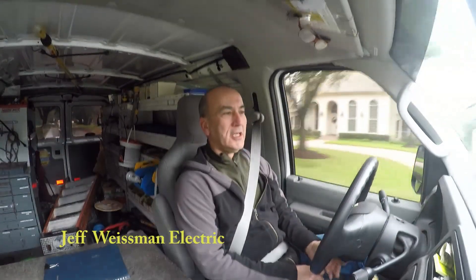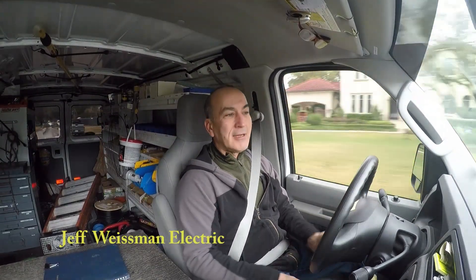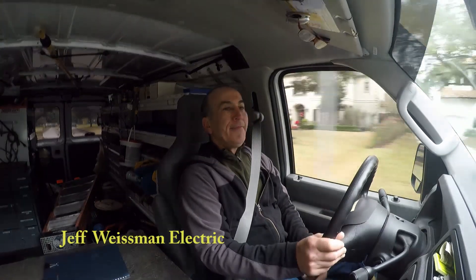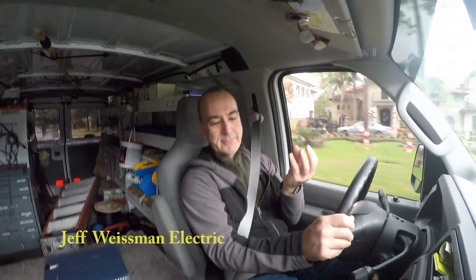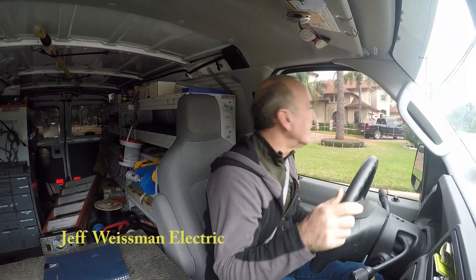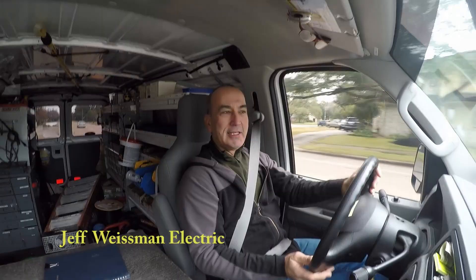The nuisance is your Christmas lights, your sprinkler system — and especially for us in the last couple of days, we got pounded with a lot of rain. The streets are still wet, there's still water standing in the streets. Water gets into the little socket of your light bulbs sticking up on the roof of the gutter. Water gets in there like a little cup, and that GFI is sensing a little bit of voltage leaking.